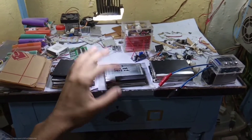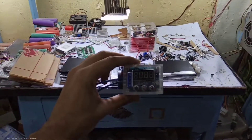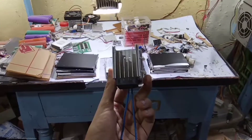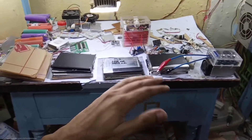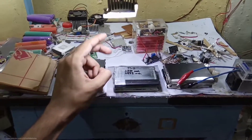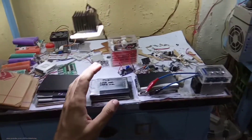I've been testing these cells for the last 6 days and every time I tested them it showed a different value on this ZB2L3 capacity tester. It shows a little bit higher value but that's fine because we just need to know which one is high and which one is low. It was actually the cells — it had been almost 2 years since I bought them without opening the pack, and the cells were at like 2 volts, 1 volt, and some even at 0.3 volts.